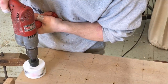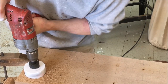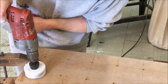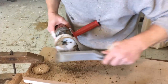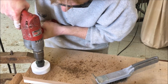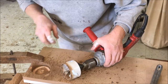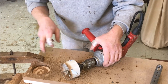I'm going to go right into our pilot hole. The teeth are clogging up — I'll clean the teeth out with a wire brush. We're through the MDF, and now we're into the maple. I'm not going to drill all the way through right now; I'll drill through the MDF first, and with the pilot hole going through the maple, I'll come back and drill the maple second.